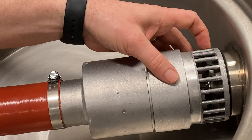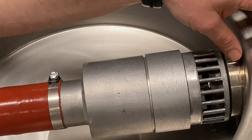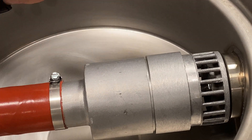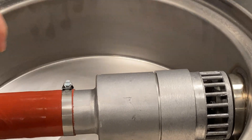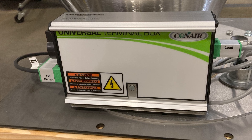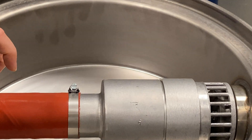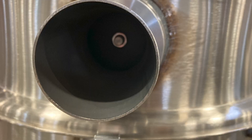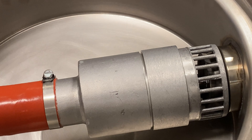When it's out like you're seeing right now, this vacuum line is closed — no resin can be pulled into the vacuum receiver. But when there's a demand signal, that demand signal will go to the universal terminal box. The terminal box sends the signal and the air necessary to the solenoid, which will then open this valve and allow vacuum to pull through this receiver.